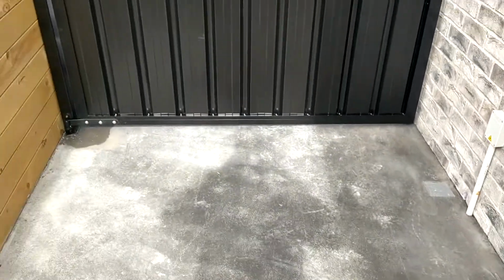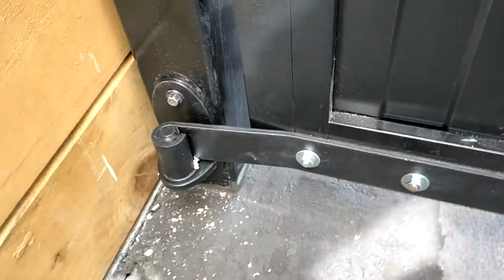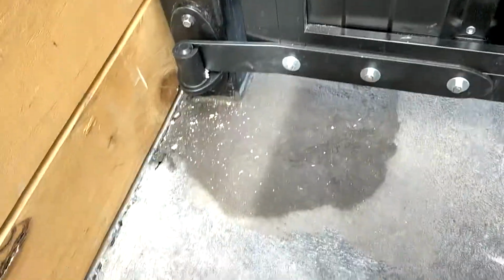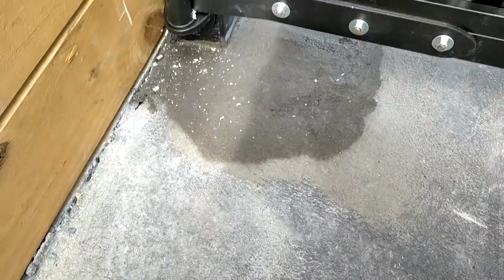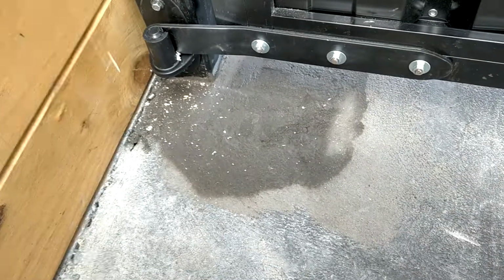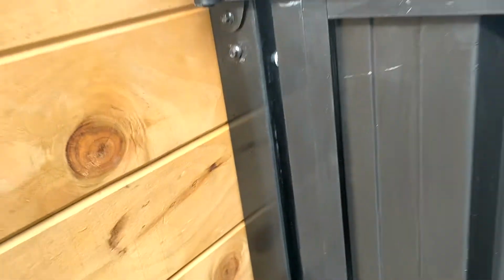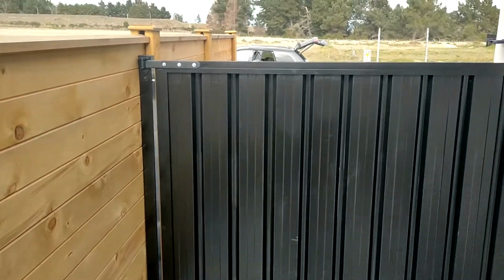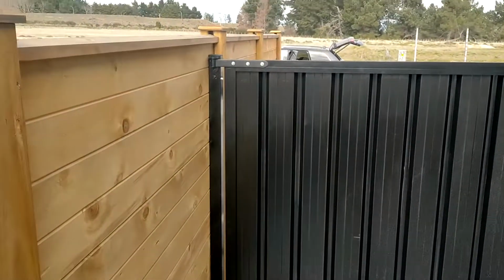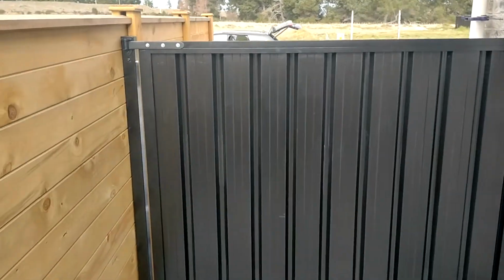That's what it looks like from the inside. We have these heavy duty strap hinges, and also we've had to cut into the concrete and match the oxide and the concrete that they have here, so we were able to match that. So if you've got concrete, that's no problem, but we were able to cut into the concrete, put this post in, and there's just one bolt fixing this back to the fence. You need a top bolt on fences like this. Generally we want to put a top bolt in just to stop the flexing this way, unless you want to have a big giant sort of 100mm post or a 125 post. This is a way to get around that.